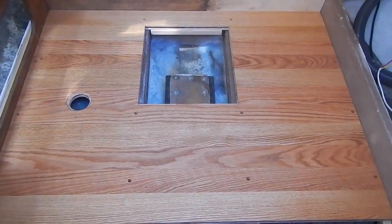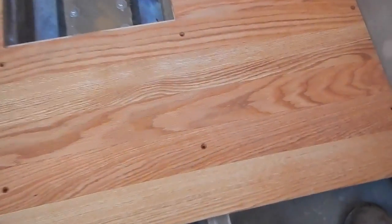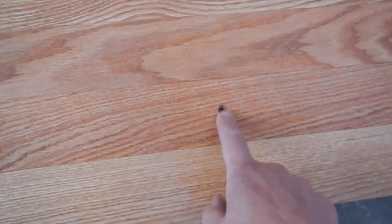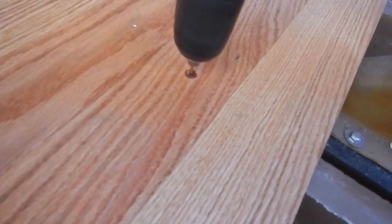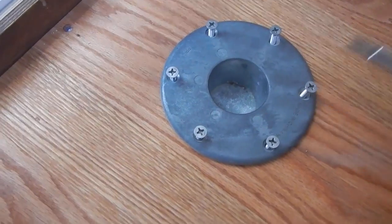So the forward finished flooring piece is now in place in the cabin, and we need to screw it down into the stringers, the fiberglass stringers towards the center of the boat and the wooden stringers on the outside edges. And we've got some screw holes started in the floor for that, but we need to drill pilot holes into the stringers, and then we can drive the screws home. I was worried that the fiberglass wouldn't have sufficient holding power to hold the screws well, but it does. And now we'll repeat the process with the side panels. And finally, the socket for the table leg.